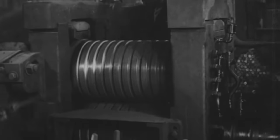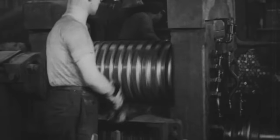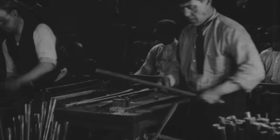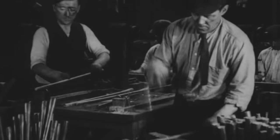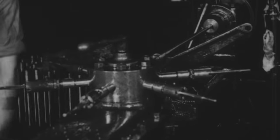Okay, what... Asbestos shirt. That looks like wire straightening, steel straightening. Or possibly making it all of an even diameter. Oh, no, yeah, it's gauging. That's right, look at how it reduces in diameter. Rolling, yeah, it's rolling, because they're not very straight. No, well, these guys are getting them a little straighter. So that's basically pre-drilled barrel blanks being straightened.